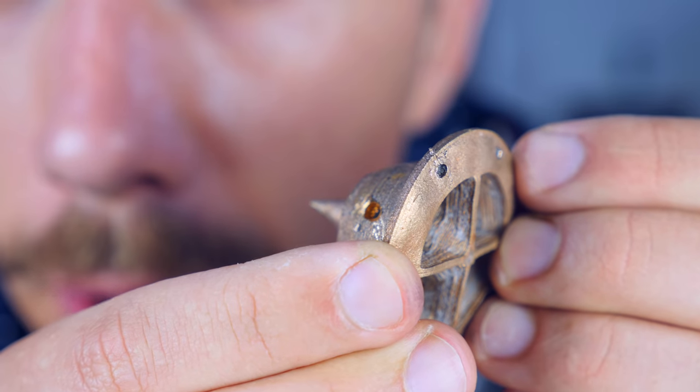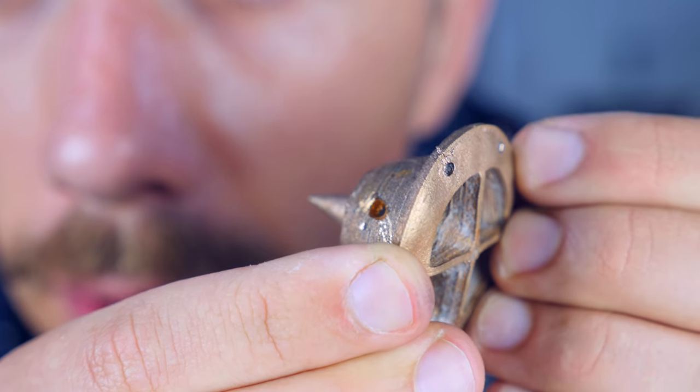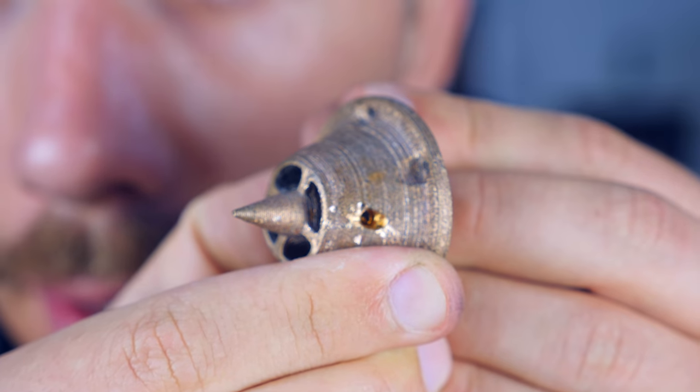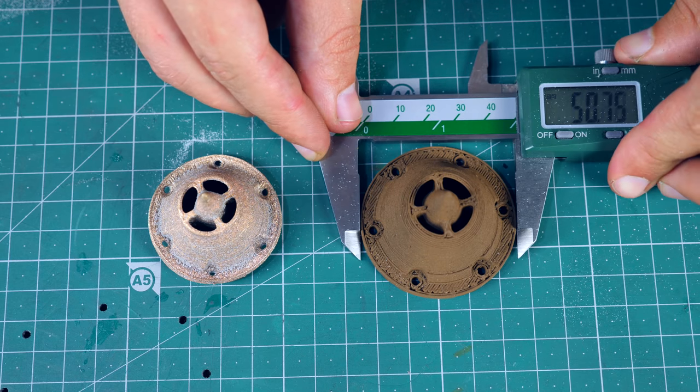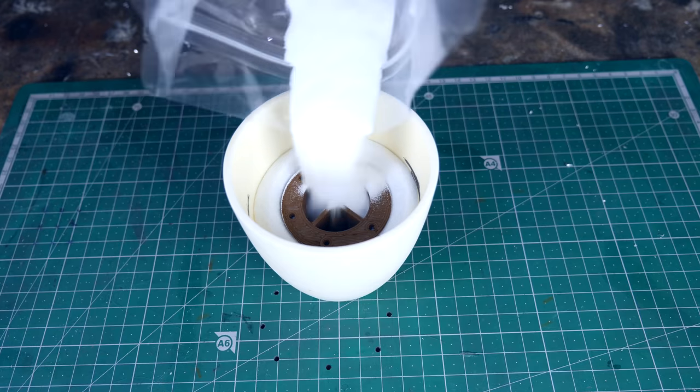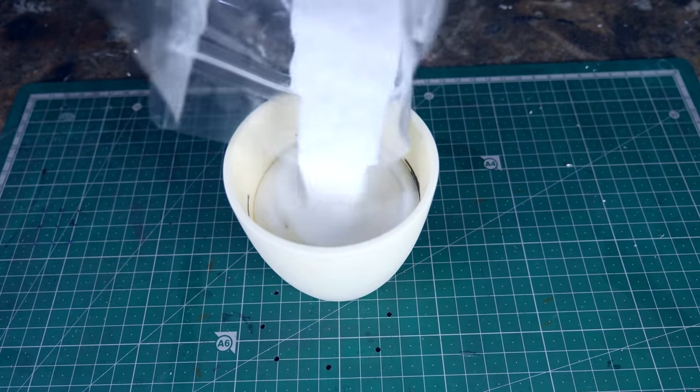I made a hole in this part and as you can see, it's solid all the way through. All the plastic is gone, everything is sintered and it's all solid. The part was a little bit warped and a little bit smaller, but that's exactly what happens when you burn the 10% plastic out of it — it shrinks. The warping probably happened because I didn't pack the alumina sand well enough. It's not a complete success, but it was literally my first attempt. And what did I get? A solid bronze aerospike nozzle. It's pretty amazing. I've been trying to use 3D printing to get solid metal parts for a long time. And here I have it. It's awesome. And not expensive at all.